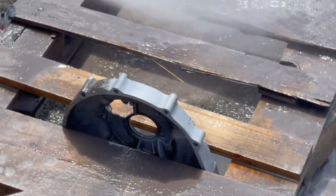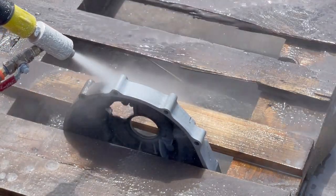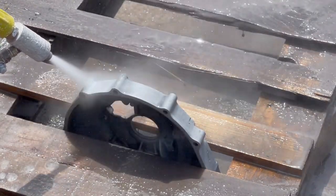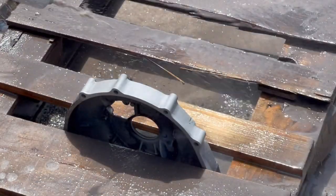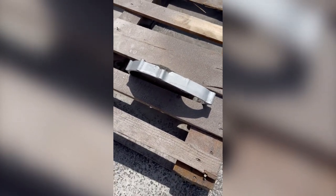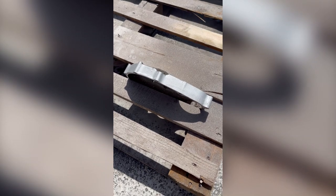You can see in the video it did it very quickly. So if you're going to polish this part, you'll have to run it through a glass bead — but we had to get the part clean first, and glass bead was not going to do that, especially not remove paint. If you're going to paint the part, it's now prepped and ready.